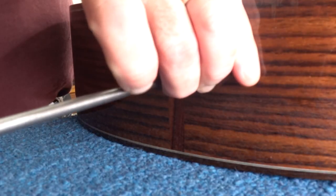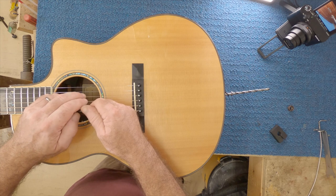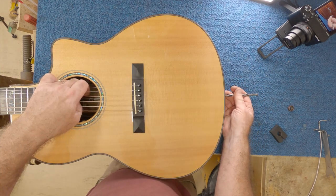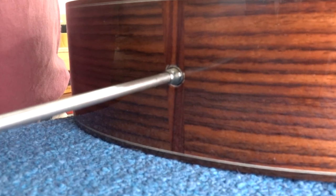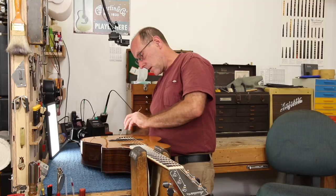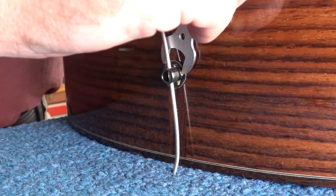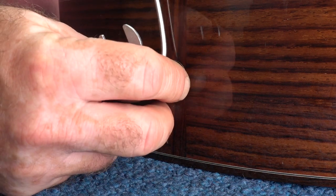We put it back onto the post, bring it out and check. That still looks a little bit too far in for me, so same thing again — back it off another two turns roughly. Lock those together so that the shielding cover doesn't come loose and rattle, and then feed it back into the hole. I might have gone a little too far on this one, but we'll see. Tighten it up just to check. So now this nut has been marred up a bit for the same reason — when I first went to take it off, I went to grab a half-inch wrench as you would find on a Switchcraft, but it's actually a 12 millimeter. Coming in with a 12 millimeter and it's really tightening down, but I can still turn this jack. So that tells me I'm tightening against the large face before it's hitting the side — not a problem.